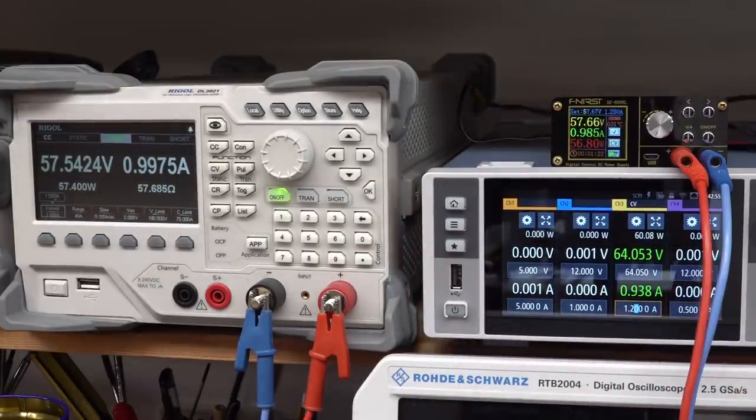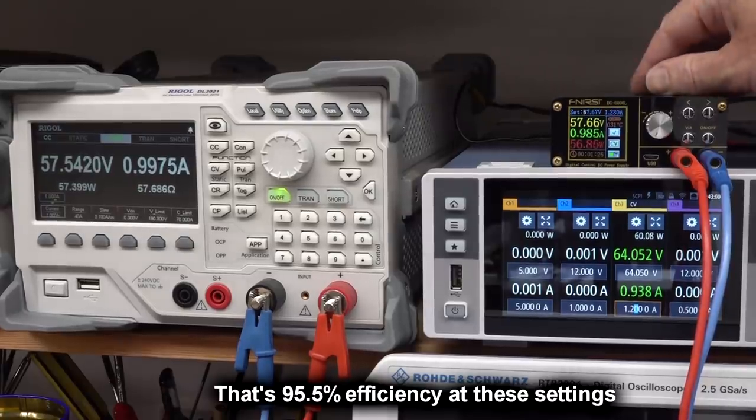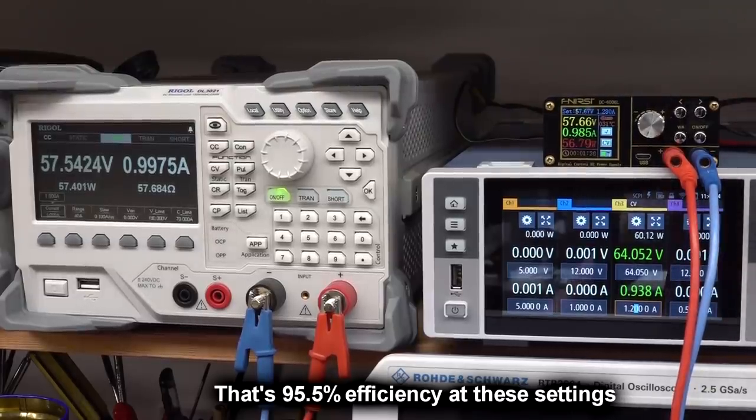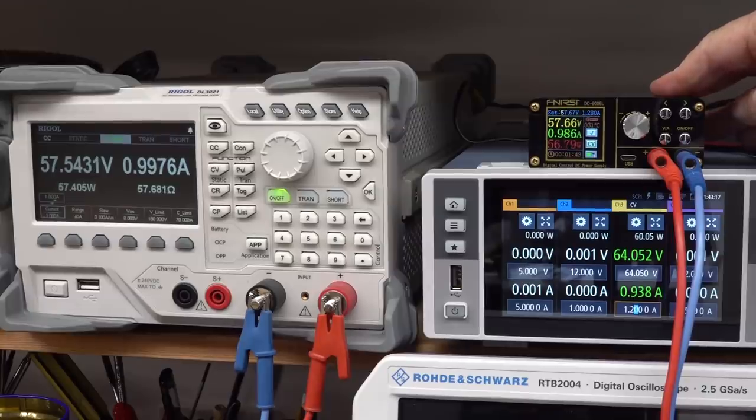Because these things are going to be quite reasonably efficient, although you'd have to do the full characteristic curve. It's actually a lot of effort if you want to get the full characteristic curves of all this for the different voltage range inputs, and you have to get a parametric sweep of all the different voltage inputs to output versus output curves. So you need multiple curves, you can't just get one.